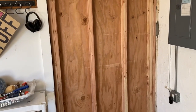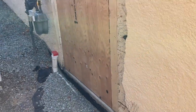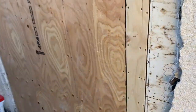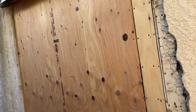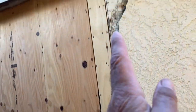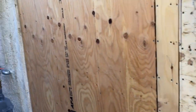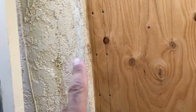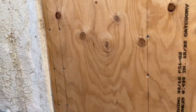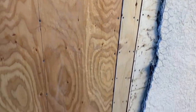Now let's go outside and I'll show you. The stucco has been applied to the old wall. Here's the exterior - I've got this door out, I've got it framed like I should inside. I have the new sheeting on and I have the stucco chipped back here on the carport side. On the house side they had just stuccoed up to it and then had a trim board over, so that's not disturbed. My partner's cousin - he's a retired stucco man - is going to redo the stucco, so I'm getting it prepared.